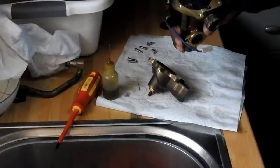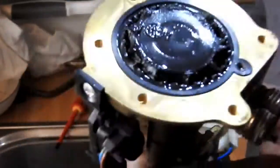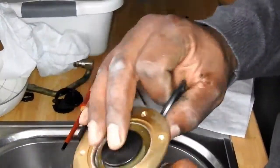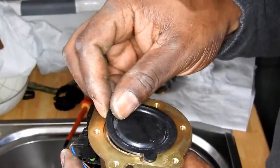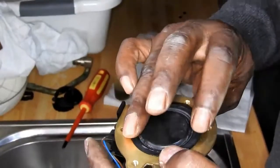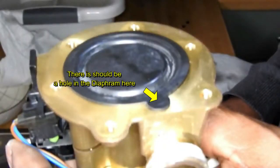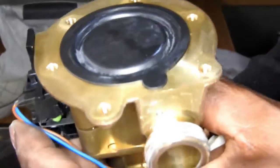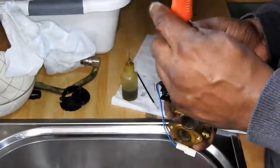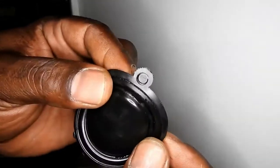As you can see, the diaphragm is perforated — it's collapsed, and that's why there's no heat; it's not working at all because it's damaged. Fortunately there's a new one in the kit. The diaphragm lets water through — I'll get to that later. So I'm just reassembling the diverter valve.